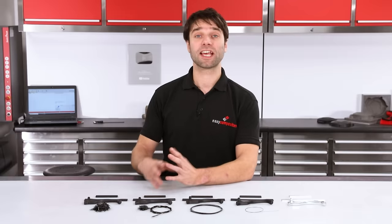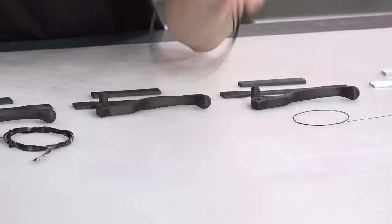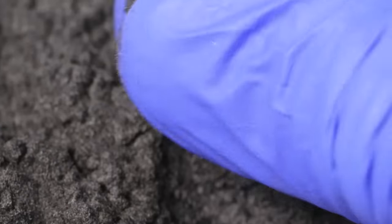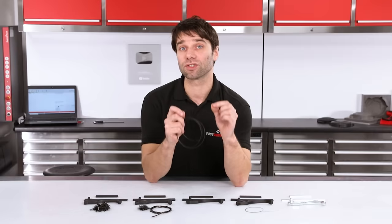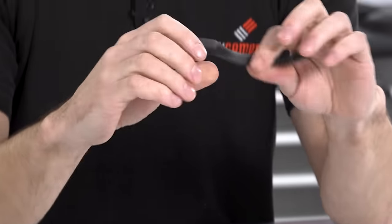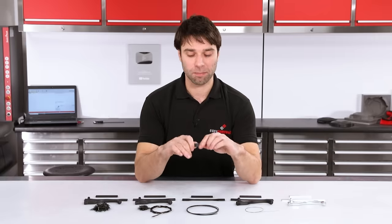These forged parts have been made in molds that have been 3D printed, but of course it is possible to directly 3D print with carbon fiber. The most common way of doing that is to use a filament that has a milled carbon fiber filler in it. Typically these are very short strands of around about 30 microns in length and these just add additional strength and stiffness to the polymer that you're printing with. The parts have been printed at 100% fill, so this is about as strong as you could get from a conventional form of 3D printing.